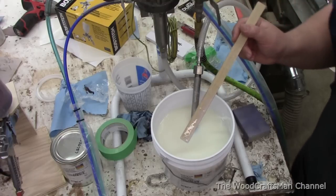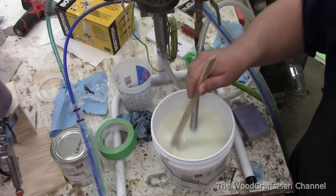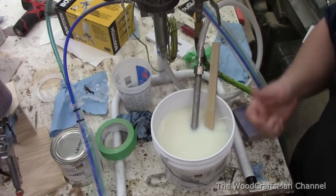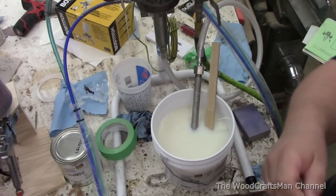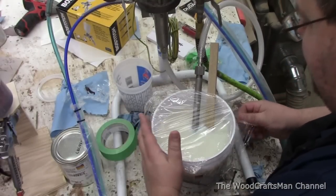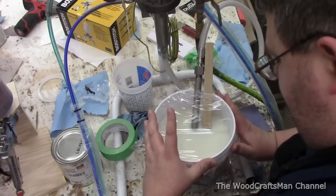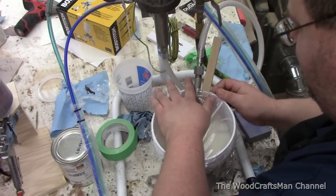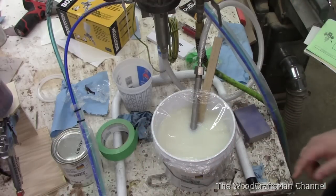And as far as the odor, it's a very low odor again, mostly because it's just a waterborne coating, but there still are some co-solvents in here, so keep in mind that there is some hazardous materials in here, but at a very low volume. So I'm just gonna cover this back up, because again, this is an evaporative finish, works off of evaporation, so it's important to keep it covered up during use or when you're not using it. So this will slow that process down.